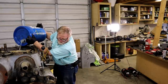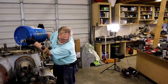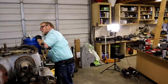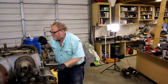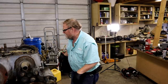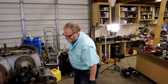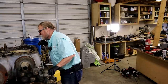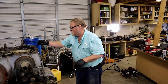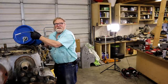Kind of watching the oil level window over here. When you're putting in fresh oil, you gotta be careful because it's clear. It's already picked up to the oil level and it's not clear anymore. Must have washed some of the old oil out, but I bet that's the diesel that was left in. Got everything out as much as I could. Now, it's going to be an initial oil charge. I'm going to put a little bit more in there because the filter housing isn't full yet. And it likes it.